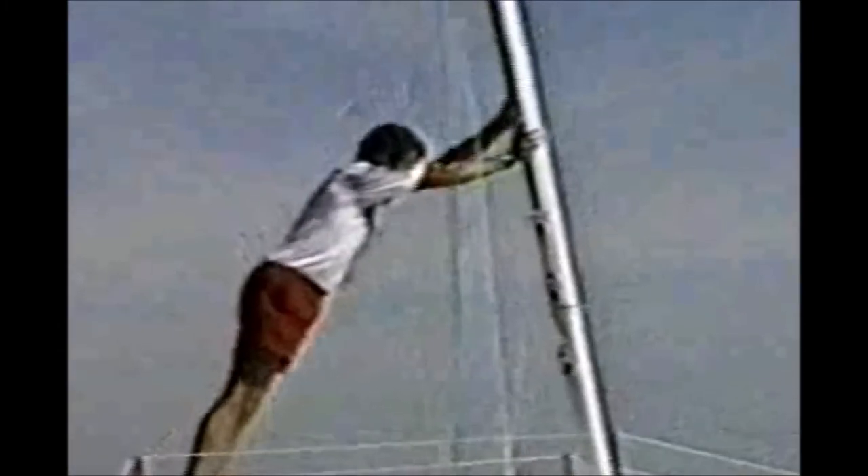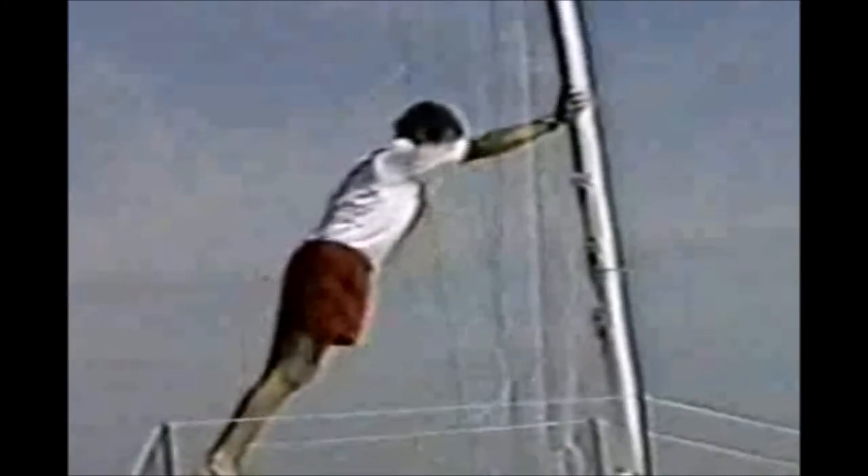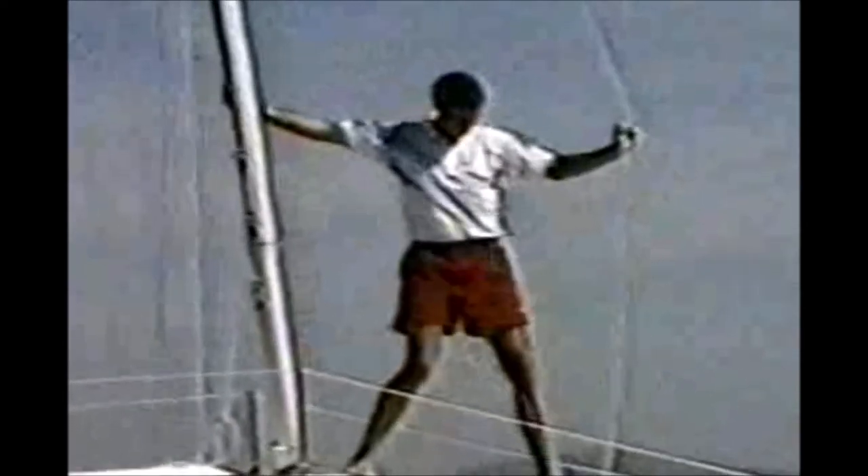Get back up on the cabin top, make sure the hatch is all the way closed. Pick up the jib halyard and the forestay, gather the lines and ropes on the mast, watch the mast crutch for tangles under the mast bolt, then slowly and steadily push the mast up — it's a slight lift and then a shove. Then grab the halyard, walk forward of the mast holding tight, and cleat the jib halyard onto the port bow cleat, good and tight. Now I've got all the time I need to attach the forestay.